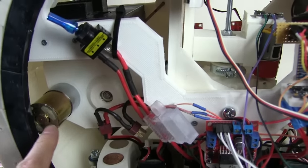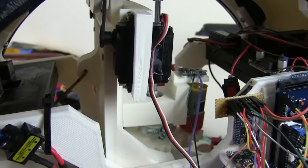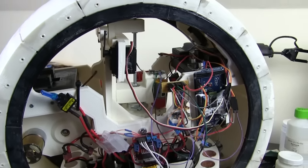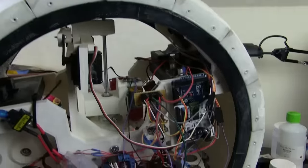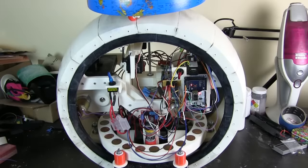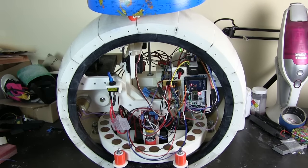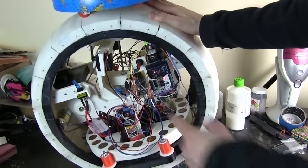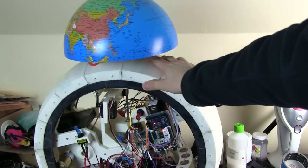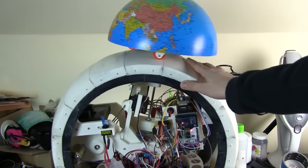The gearbox is installed — there's the motor, which doesn't run on the rim, and that's the bearing where the gear is on the inside. I've used this 3mm piece of steel to go onto that hook, and there's loads of torque. It runs incredibly quickly, so the next thing is to PWM control it and control it for dynamic stability. I've upgraded to an Arduino Mega which has got more PWM outputs so I can run all the things. What I've now done is applied stability to the head stick with its accelerometer so it always stays upright. If I roll this now, you should see the head tries to always stay on top — and you can see it moving — and you should be able to see the head always tries to drive to the middle there.